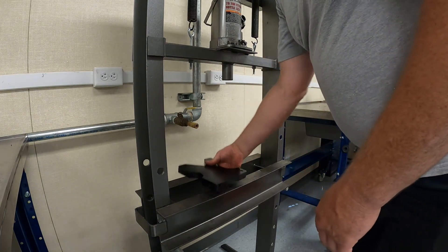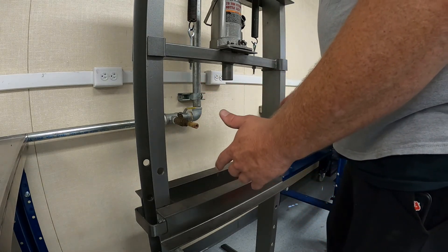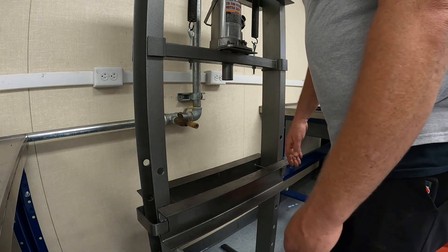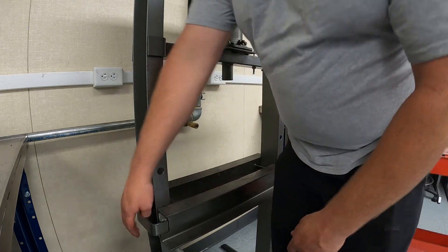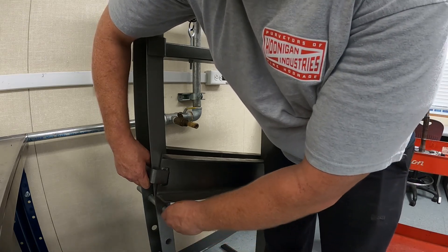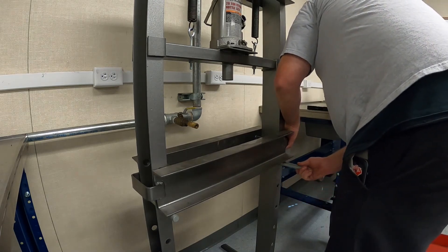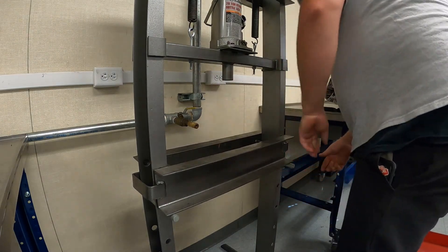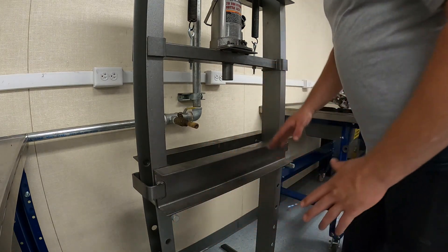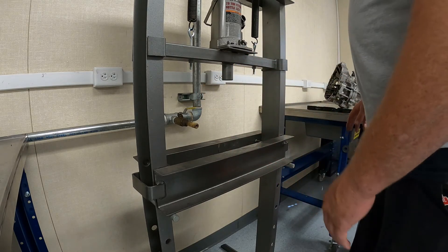To do this on this type of hydraulic press, we're going to clear the deck - removing everything off of it to reduce the weight, but also to prevent stuff from tipping off and potentially falling onto our feet when we lift with the handles. Usually it's best to lift up on the handle and go up one peg position at a time. We want to double-check that the deck is level and that the pins are fully in place supporting either end of the deck surface.